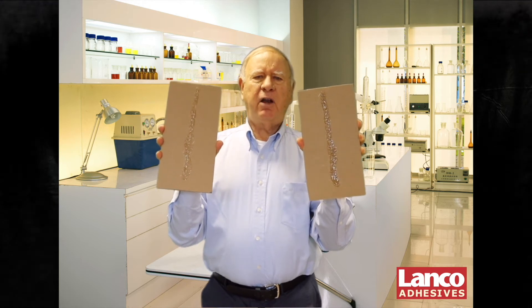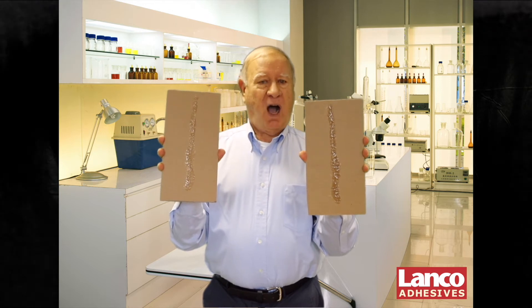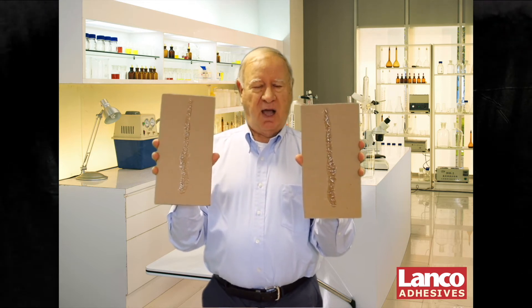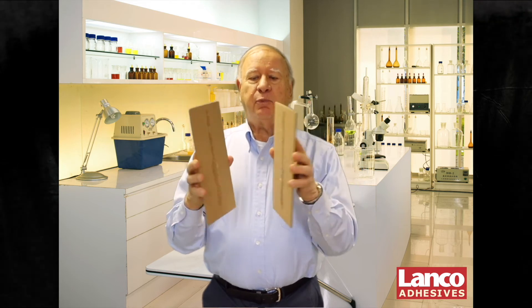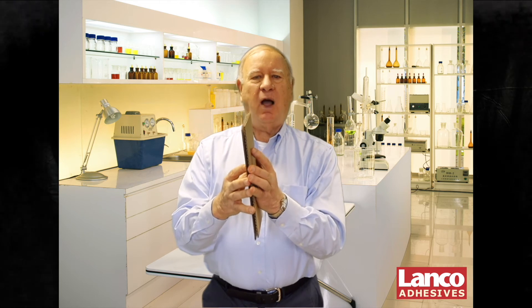There are a number of reasons why this might happen. The adhesive might have been too hot when applied, there might have been too much adhesive applied, or the compression may have been too short, or it may have moved while it was under compression.